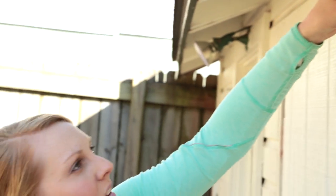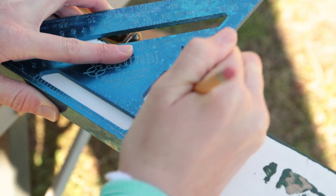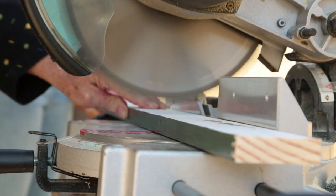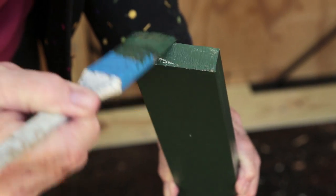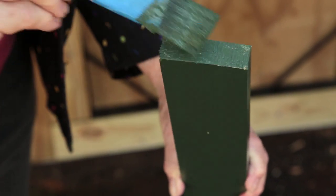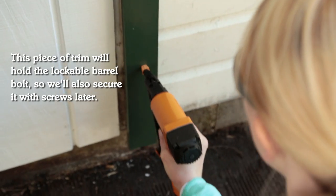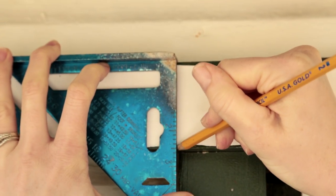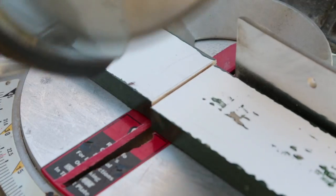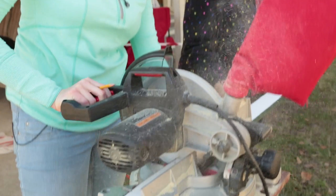We're going to start off with the outside of the door and work our way in. It's important not to leave any raw edges exposed to the outside elements, so after cutting each board, we cover the ends with a little paint before nailing them up. After nailing up the two side pieces, we measure and install the top piece to cap it off. Next, each half of the Dutch door will get trimmed out on all four sides, creating two square frames.